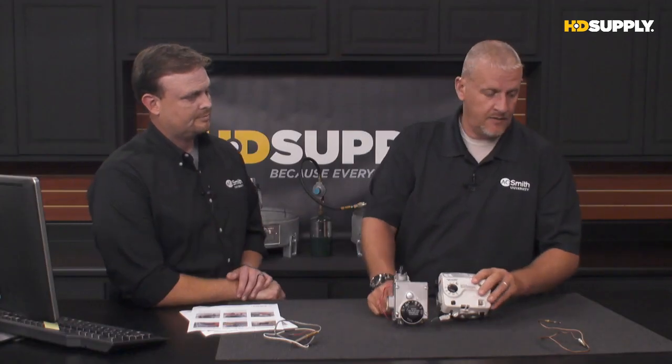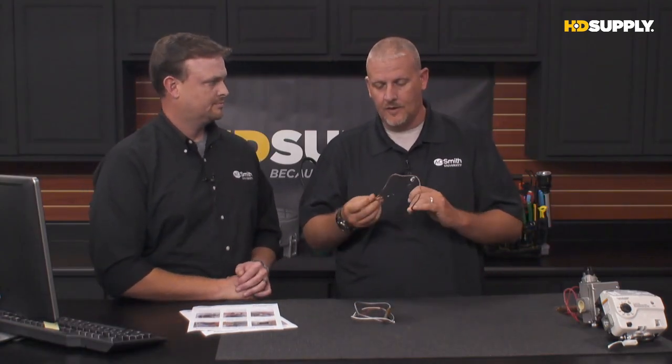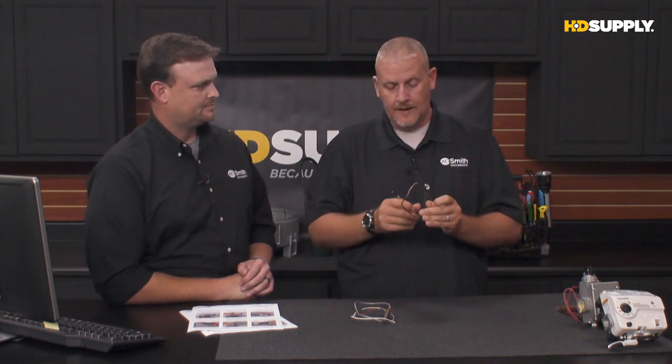Now, as we stated, they don't plug into the wall, so they need their own internal power source. Now, for decades, that's been done with what's called a thermocouple, right? On a mechanical style gas valve, and we have one right here. This is just a standard Honeywell 24-inch thermocouple. This was the standard for decades and decades and decades. This is what ran the older mechanical style valve.